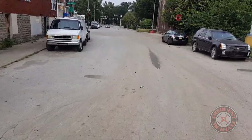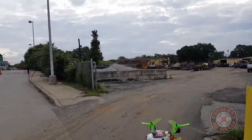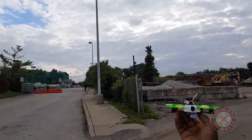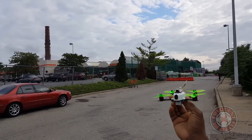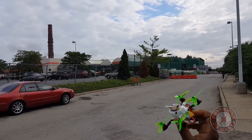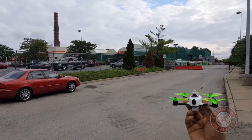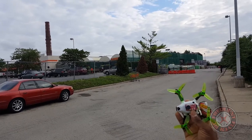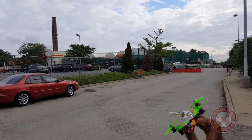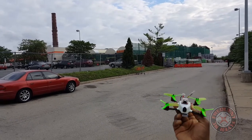So it works, but I just need to lower my voltage cutoff point. I have the minimum voltage in Betaflight set at three volts, so at three volts the quad just falls out of the sky. I'm going to set the minimum voltage to about 2.8 volts — that'll give me enough time to bring it back in. This LiPo tester can't be changed from three volts; it only alarms at exactly three volts, so I just set the Betaflight minimum voltage lower.